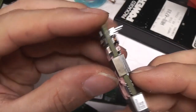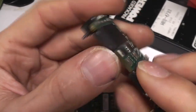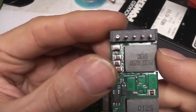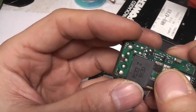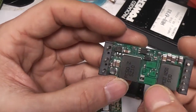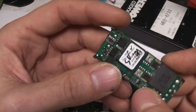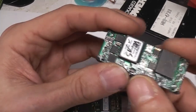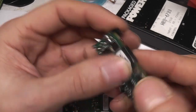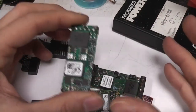The interesting technology these things use is planar inductors. You can see the PCB itself is quite thick, and the inductor windings are actually PCB tracks - they just fit ferrites over those PCB tracks to form the inductor. No interconnectors, very small and compact. To achieve small size, these converters tend to run at quite high frequency - anything from 500 kHz to a few megahertz - so all the switching nodes need to be really small to avoid the effects of stray inductance and stray capacitance. This is also one reason why you'd use a packaged DC-DC rather than just using chips on your board, because this type of thing needs a board with multiple layers.